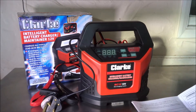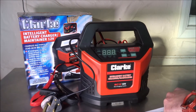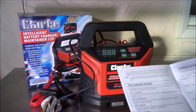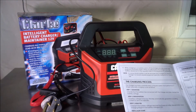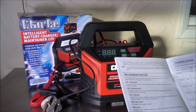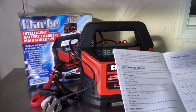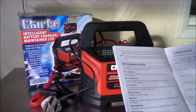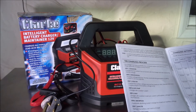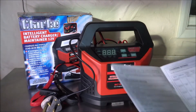Don't confuse this with vehicle alternator outputs of around 13.8 volts — that's part of a car's charging system and is different. After analysis, step four does a soft start with constant current. Step five is bulk charging with maximum constant current until the battery voltage reaches threshold. Step six is absorption — a gradually declining current charge to the battery's maximum voltage. Step seven tests whether the battery can hold a charge, then step eight is maintenance mode.